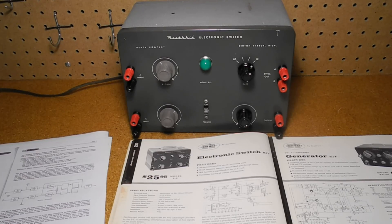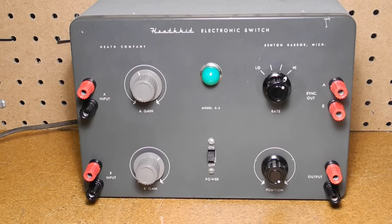This is the first electronic switch I've ever worked with. In the past I was skeptical that these units were particularly useful and thought they were more of a gimmick, but it worked surprisingly well. At the time, most scopes were single channel units with less than or about 100 kHz bandwidth, so this would quite effectively turn it into a two-channel scope. The unit is about 60 years old with almost all the original components and still works — quite a testament to the robustness of the design and components. In contrast, the average lifetime of a smartphone in North America is about two years and getting shorter. I mentioned earlier that this type of unit is pretty much obsolete today. A similar device that does still exist accepts several, often digital-only inputs — maybe eight — and displays them as separate signals on a scope trace to effectively turn the scope into an eight-channel logic analyzer. Circuits for doing this can still be found in books and hobbyist websites.